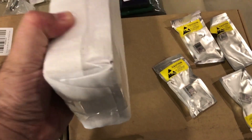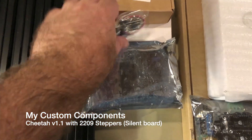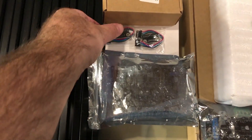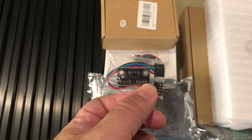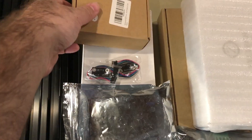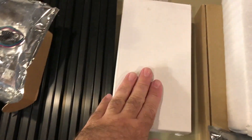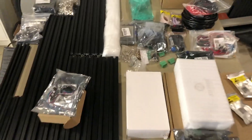So what I'm going to be using in its place will be a Cheetah board. This is a Cheetah version 1.1 — it's a 32-bit board with 2209 steppers. I'll have the link in the description. And then there's also these little parallel motor boards — I only need one of these, but it's for the Z-axis. I've also got some 24-volt fans here: a part fan and a cooling fan. And then I've got a 24-volt, 360-watt power supply in here.